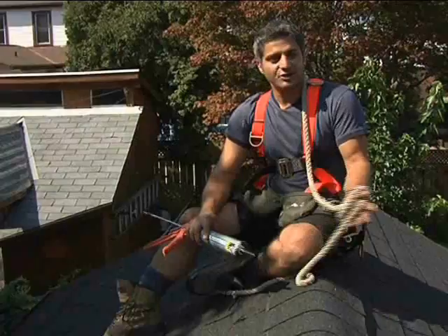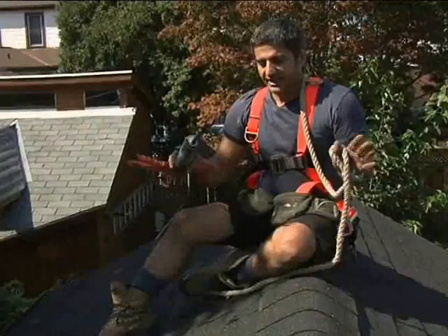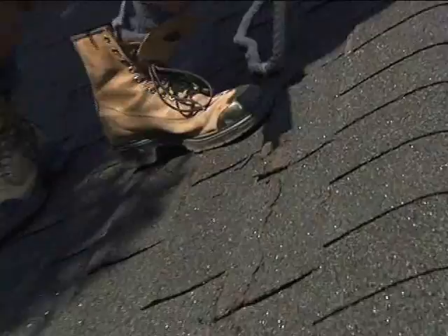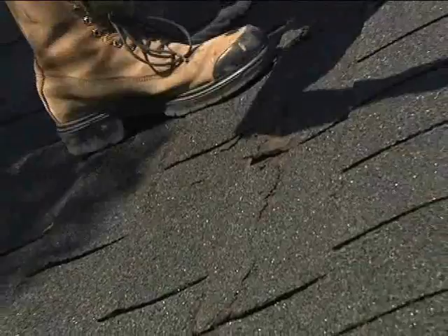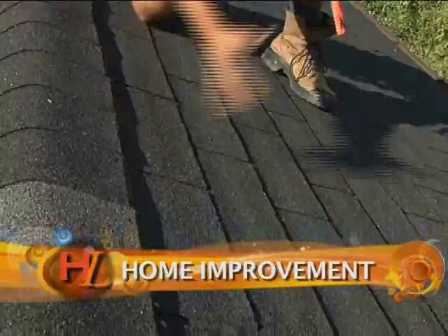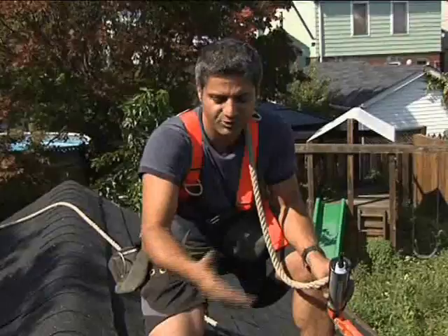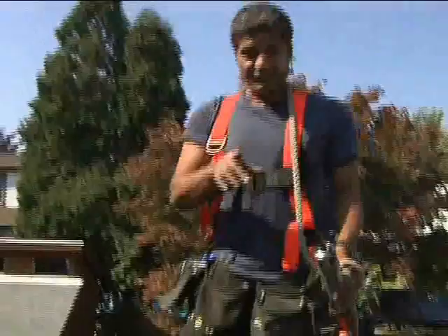Hello, welcome to our job site today, I am Just Ask Bob. As you can see I'm sitting on the job today, but only for a moment. I like to talk about roofing projects. Interesting on this roof, we have south side facing and north side facing. If I could take a moment to show you how the shingles have worn — bear in mind this roof is approximately 10 to 15 years old. On the south side, getting beaten on by the sun, you can see the shingles are coming unglued, the granules are literally coming off and disintegrating. On the north side, they're tight, adhered, nothing really wrong with them. There's a little bit of deflection which is common in this 60-year-old garage. Now I want to show you how to safely do some roof maintenance. Don't climb a roof unless you're safe — tie yourself off and only climb if you're comfortable.